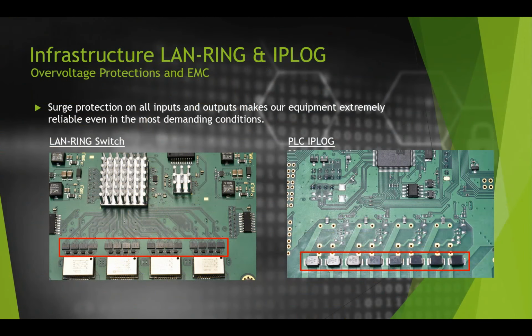We design the equipment with the assumption that it will be used for 10 years or more in 24/7 mode. The minimum warranty period is 5 years and also applies to outdoor applications where there is a high risk of lightning damage. This is also why basic company standards include an emphasis on their resistance to overvoltage. All interfaces are fitted with protective components such as transils, varistors, and lightning arrestors. From the point of view of production costs, this brings about an increase in production costs. On the other hand, this measure drastically reduces the cost of warranty repairs.